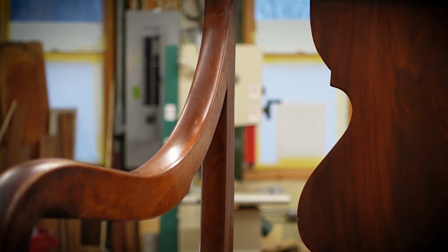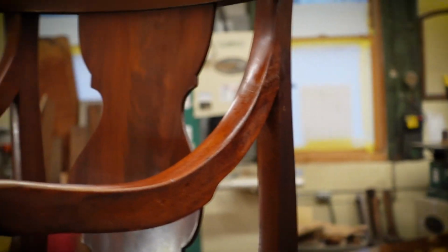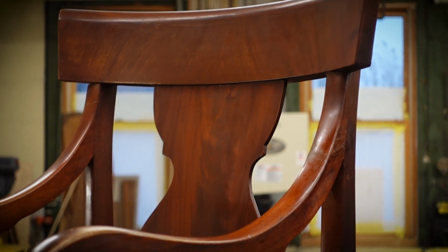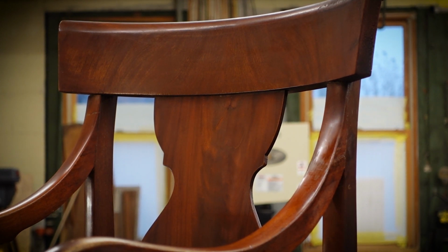what we're gonna have to do at this point is seal that down. So we have some color on there and we have our lacquer on there, but what you're gonna run into now is it's gonna dry, it's gonna look dull, and you're gonna see the brush strokes. So in order to eliminate that problem, you need to bury it in some lacquer. There's a few ways to do this. Most furniture touch-up guys at this point would probably go straight to an aerosol can like you see here.